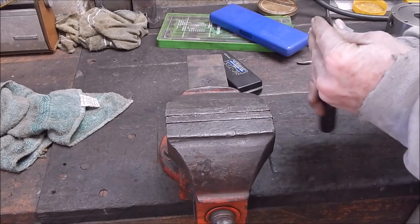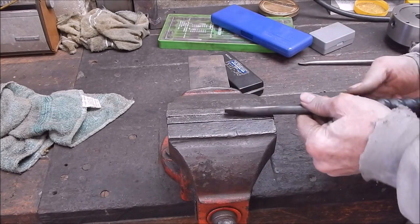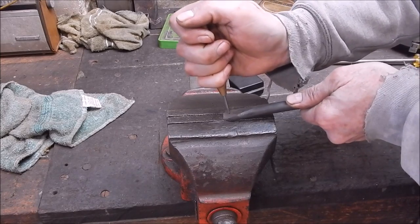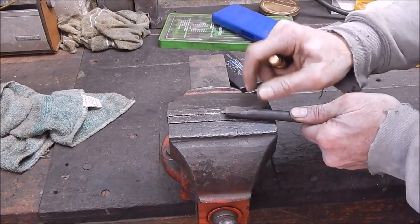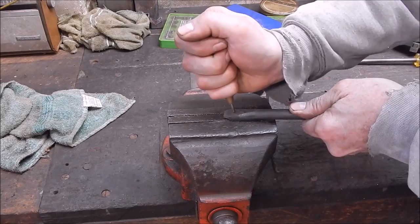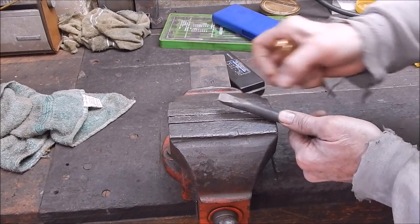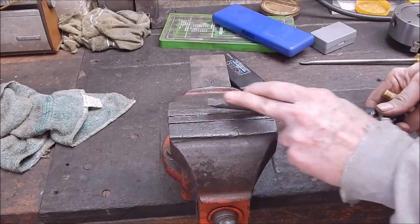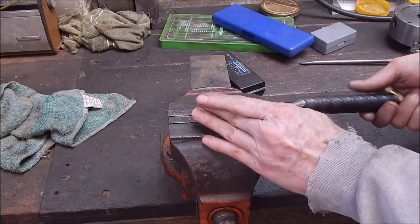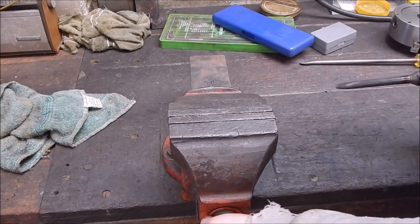So how hard is this thing? Turned out okay — that means it's just a prototype, rough and ready, that'll do the job. Let's try it with the auto punch — that's always a good test. Ooh, that is rock hard. Barely made a scratch in it, so that is super hard. Now I did temper this after I'd hardened it, just to make sure it doesn't chip — not anneal, temper. We'll try a bit of belting around with it and just see how it stands up.